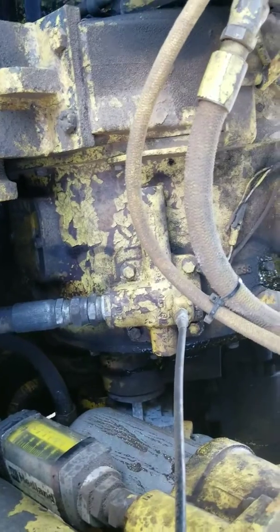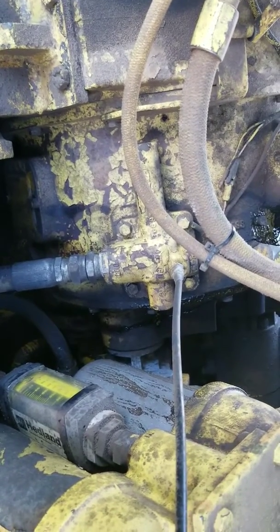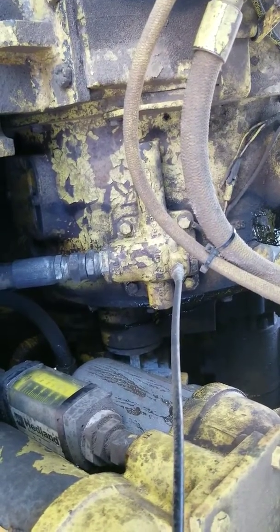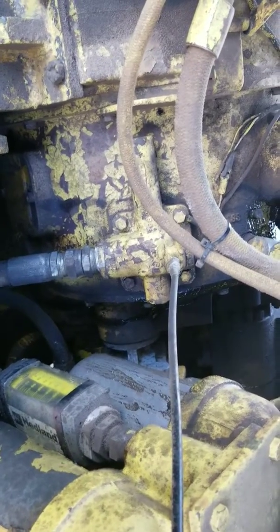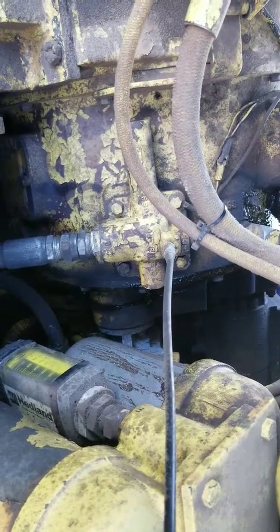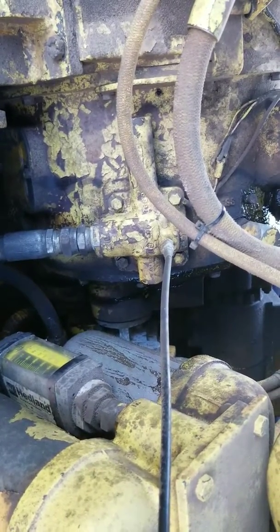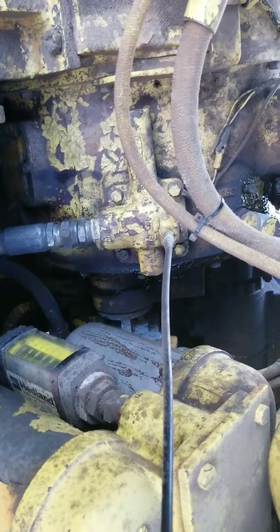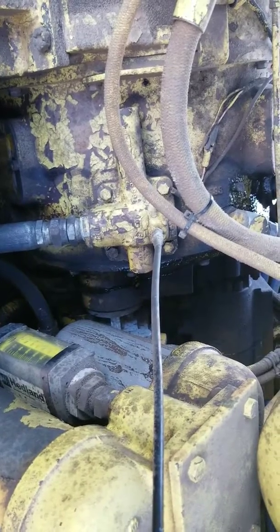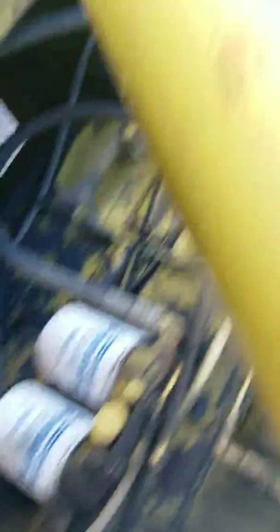On your torque converter outlet pressure — this is on an 8,000-series converter and a 5,000-series transmission, so your machine may differ. On this particular machine at 2,000 RPM with hot oil, you should have between 55 and 75 PSI of converter out pressure. Right now this machine runs at about 70 PSI of outlet pressure, but the converter itself leaks a little — right at the maximum leakage spec — which causes some heat and reduced power.